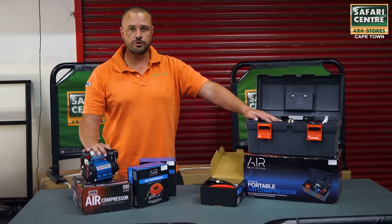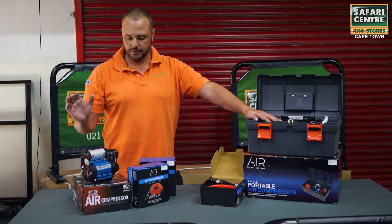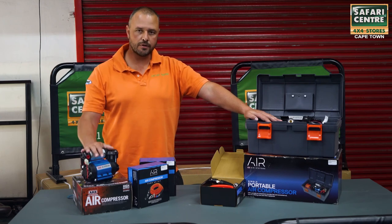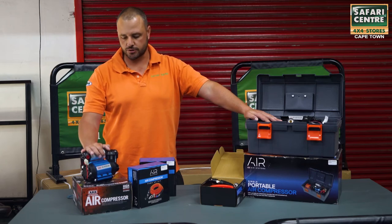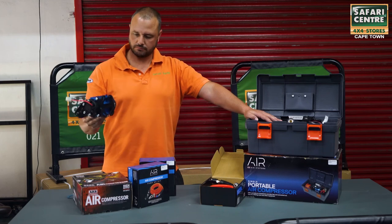The specifications on the two units are the same. They deliver 66 litres per minute and they use around 25 amps at about 2 bar. They both have high temperature cutouts to protect themselves if the temperature gets too hot, and you can also install them lying flat.